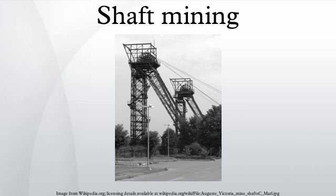This distance is determined by the methodology of excavation and the design thickness of the permanent liner. To ensure the safety of persons working on the shaft bottom, temporary ground support is installed, usually consisting of welded mesh and rock bolts. The installation of the temporary ground support is among the most physically challenging parts of the shaft sinking cycle, as bolts must be installed using pneumatic powered rock drills. For this reason, and to minimize the number of persons on the shaft bottom, a number of projects have successfully switched to shotcrete for this temporary lining. Research and development in this area is focusing on the robotic application of shotcrete and the commercialization of thin sprayed polymer liners.